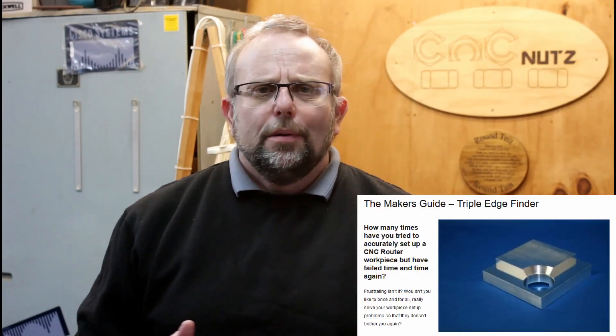But for home machines like mine I just don't see the need for it. What about resetting a zero point on a cut when you've lost position? Well, there are much easier ways. First option is simply mark where X and Y zero was when you started the cut. Another option I've occasionally used is to find a hole that I've drilled at a known point — drop the cutter in the hole and you know exactly where you are. Another way is to use a device like Bill Griggs's triple edge finder, available at cncroutertips.com — I'll put a link in the description. So you don't really need limit switches to find a lost XY position either.